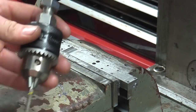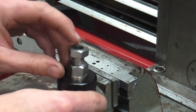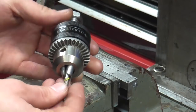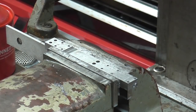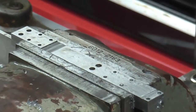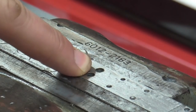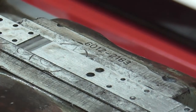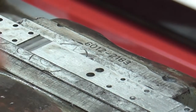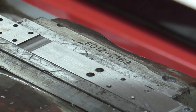On to tapping — I'm doing this in the milling machine with my tapping chuck which floats on a plain diameter and I just wind it by hand. If you'd like more details look at my video on making a tapping chuck. Now I have absolutely no idea why I thought 2BA was an appropriate size for these oiling holes — there's going to be an adapter in there but even still that's far too big. I think 4BA would have been a much more appropriate size, but I can't put any metal back on and I'm not starting again, so that's what I've got.